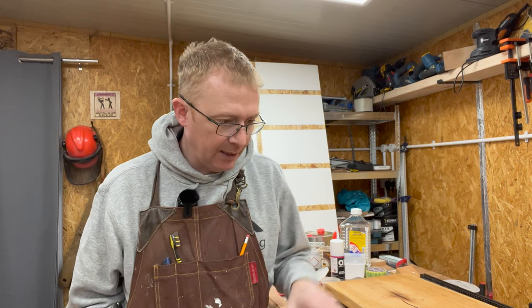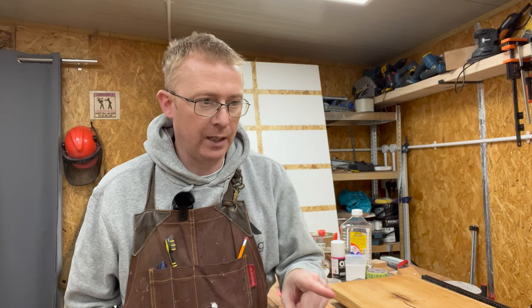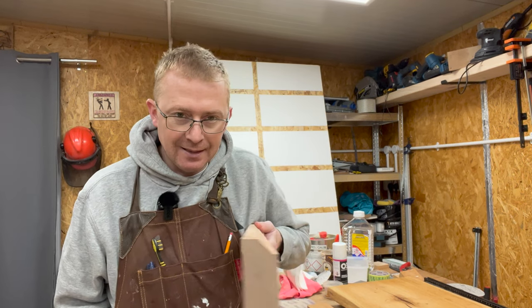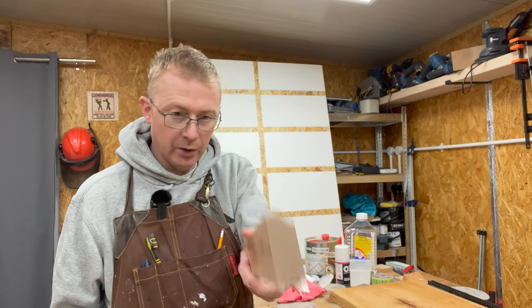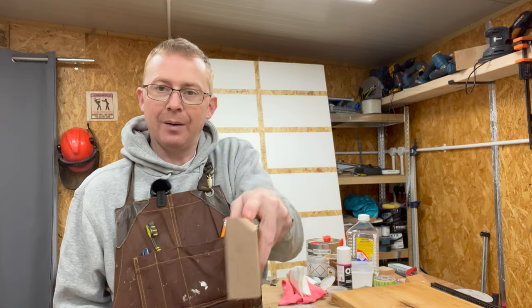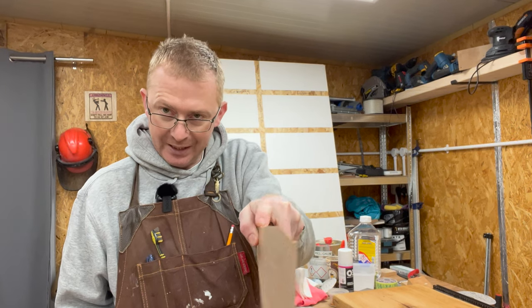Right, things ground to a little bit of a halt with this yesterday, because once I got it cut and thicknessed, and then I started running it through my router table with the 45 degree chamfer bit, that's the furthest it would go. Can you see that? And also it's left a bit of a lip on the end now. This is where the water's going to come down, but I wanted it to eat into more of it. I didn't like this bit at the top here.